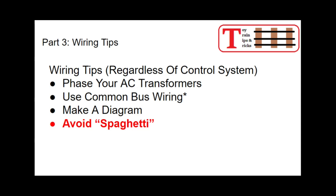Avoid spaghetti wiring — avoid wires going everywhere. Don't fall for the temptation of just quickly running the fastest route from point A to point B. Instead, figure out wiring superhighways. Use wire clips — I 3D print mine. It may cost you a few extra inches of wire to go the extra distance to keep things on your superhighway under the layout, but it will make it so much easier to trace wires and keep things neat. Make a plan and stick to it — do it right the first time.